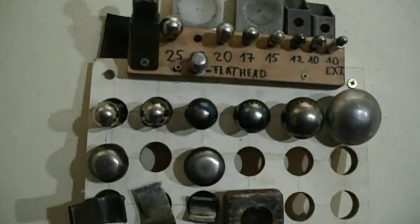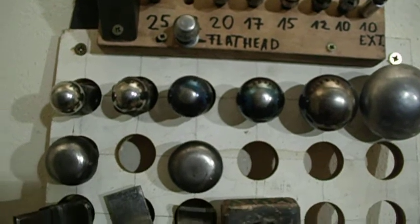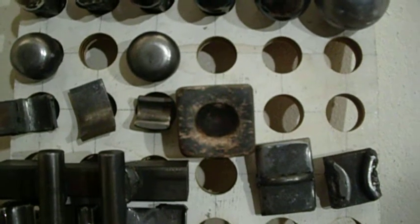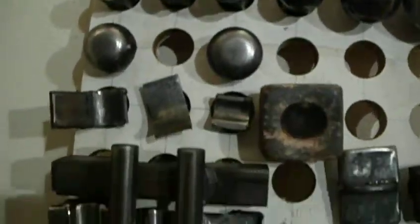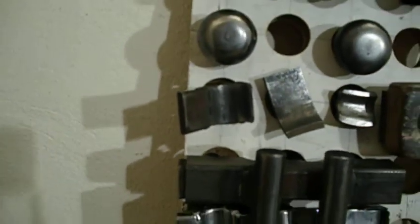Now here I show you the dies I made. Most of them are ball bearing balls welded to a stem. Then the stem goes into the machine. I got some wood bottom stems hollowed out. I got some Teflon bottom pieces hollowed out on a drill press with a disc, and I got a few special beading dies, a non-linear beading die. I got shrinking dies, more shrinking dies, and curved dies for end operations. And they just mix and match.